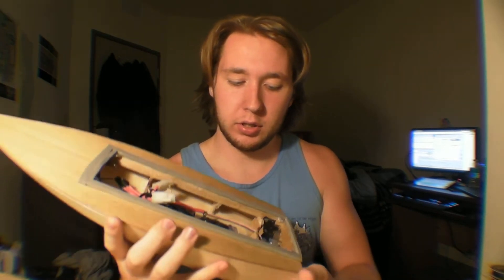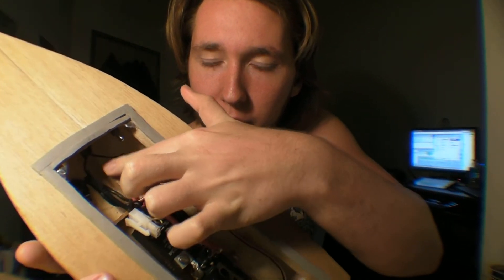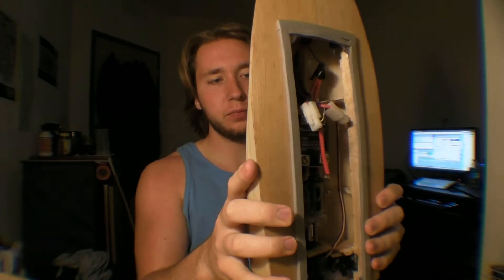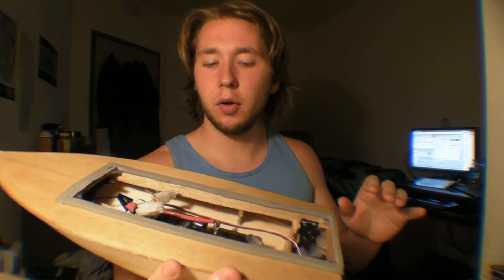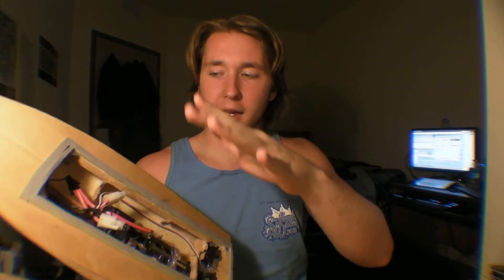I did that, and I'll probably put some links in the description to the pictures because I took pictures at each stage. The first stage I had formers, the second stage I did the stringers, and I took pictures of all these progressions. From there, you have to plank it. You can see I actually ground away this former here — there's another former up here. There was a lot of modification done to get the electronics to fit afterwards. Basically you start with the frame, then you plank it. You start with it laying upside down, with the two top pieces, build the formers off of that, then do the sides, and then the bottom. Did all that, sanded it down, smoothed it out, filled it, and then fiberglassed it.